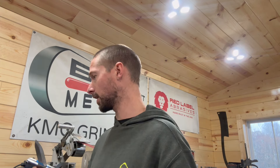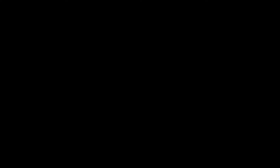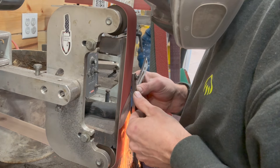Now we're going to put on a 60 grit belt. With that 60 grit we're going to bring that edge thinness down again. I'm not really going to go into details on how thick the edge is because everybody's different on how thick they like to leave the edge before adding that secondary bevel. For this knife in particular, I take it to about 15 thousandths when it's all said and done. You kind of just have to slowly work that edge to where you want it depending on what kind of knife you're doing. I'm going to work that edge down a little bit, bring my bevel height up slightly — not so high that I can't get the scratch lines out when I go to the next grit.